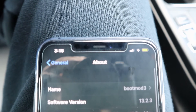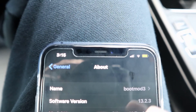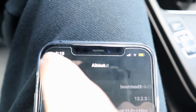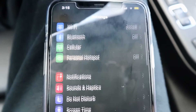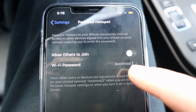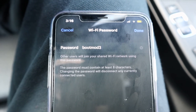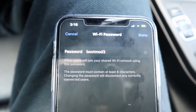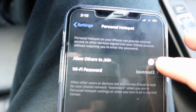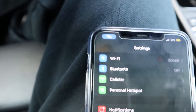We should now have access to the BM3 features through the mobile app. Everything is hooked up. You want your device name set to BM3 and also your WiFi hotspot named BM3. Make sure there's no space — I accidentally put a space and it wasn't connecting. I removed the space and it connected right away. There you go, connected right away.